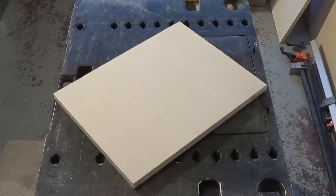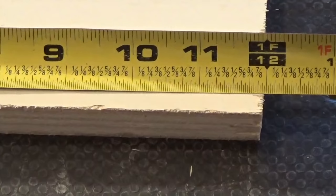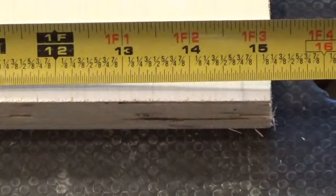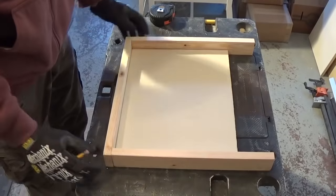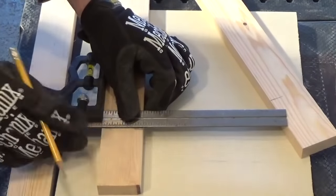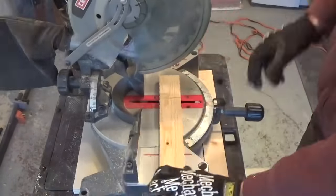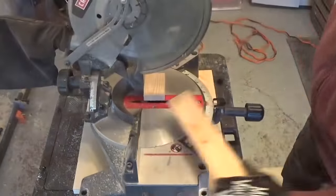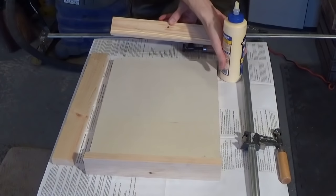After you determine how big you want your cat perch to be, cut that out of a piece of plywood. You can see this piece was roughly 12 inches by just over 15 inches. You're going to need either 1 by 2 or 1 by 4 pieces for your edge. Put those on there and mark them so you know where to cut them off. Strike the edges, cut those off, and then after you cut them off, it should look like this. The short pieces on the sides are shorter and the long one covers those short pieces.